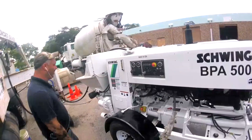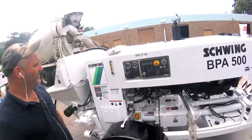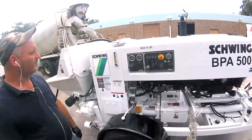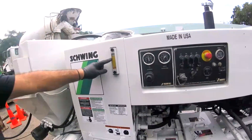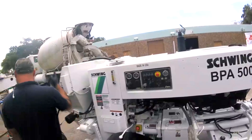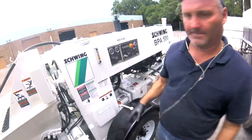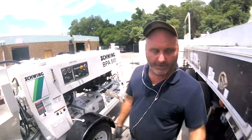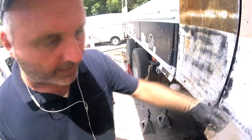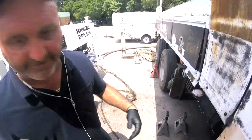I'll bring my pressure machine without turning it on and you'll see the oil start dropping. Now it's staying somewhat level — one machine is pushing that one forward. I'll start raising the boom manually, because you can't do it electronically: there's no electric coming from the truck, which disengages the e-stop manifold, so you won't be able to turn the power on the truck. We bypass that, which is why we have to do it manually.